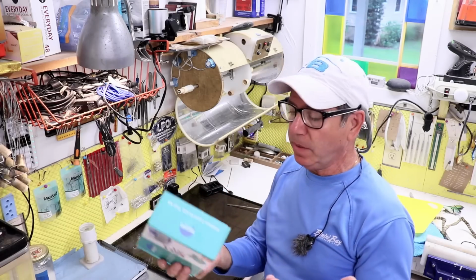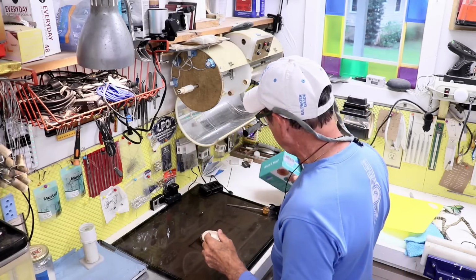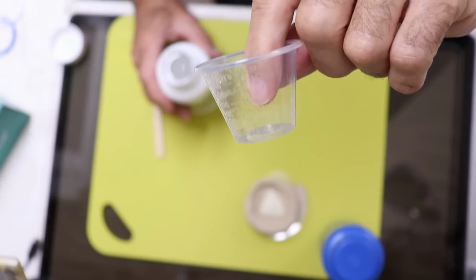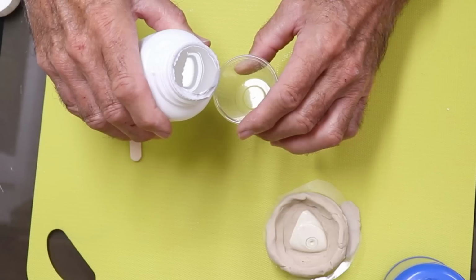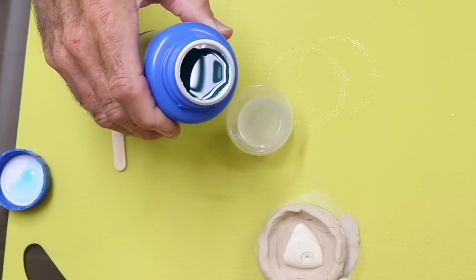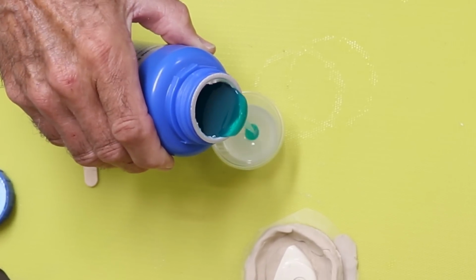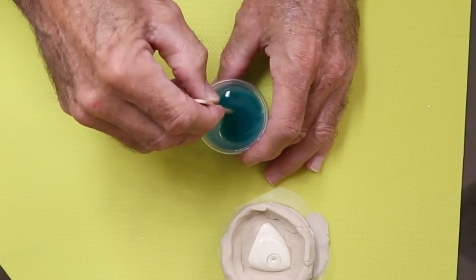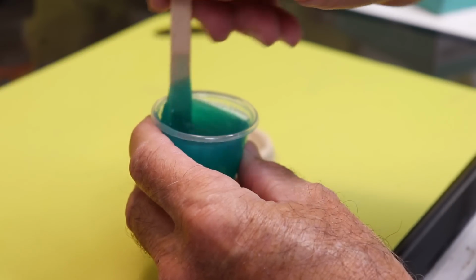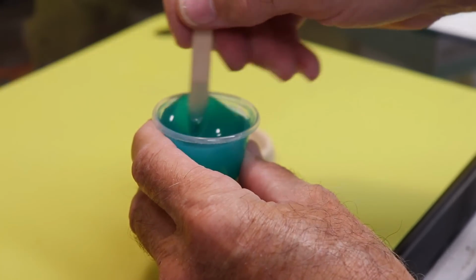The stuff is made by BB Dino. I'm not affiliated with them, they're not sponsoring me or anything. I paid for this stuff, and they ask you to mix it by volume, so let's do that. I'm gonna mix it in one of these volumetric little cups, and we'll be mixing right at 25 milliliters. Three minutes of mixing I've found to be the magic number, and 3 minutes is actually a long time.